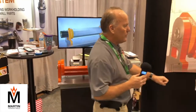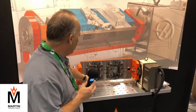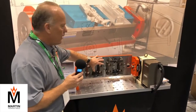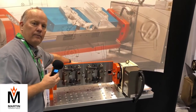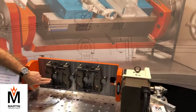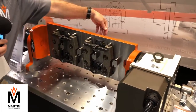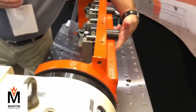We do a lot of hydraulic work-holding. On this particular part, these parts have to be machined from the back side and the front side. This is what we call a window frame fixture — there are holes in the fixture to enable a cutter to come in from the back side and machine features on the part.